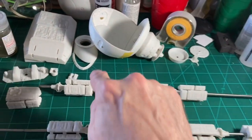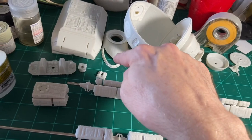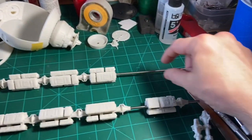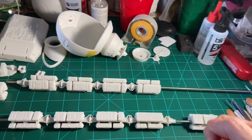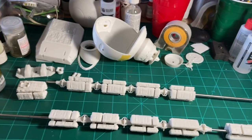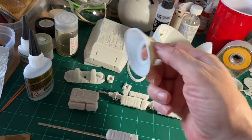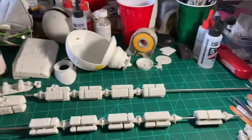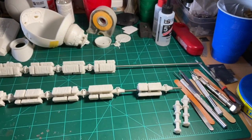And eventually, once I get these built, these parts here and this collar part, everything other than this will be glued together as well. And there'll be some aluminum or stainless steel tubing sticking through that will go through into the propulsion unit. And I'm going to likewise have magnets on the propulsion unit that will hold this piece onto it so it's removable. And again, for transportation purposes, it's just easier to take them off and get into them, that kind of thing. So, okay.